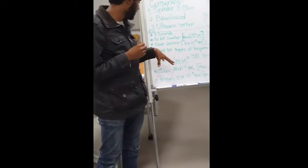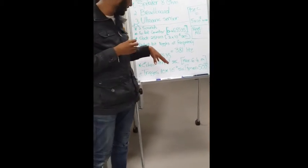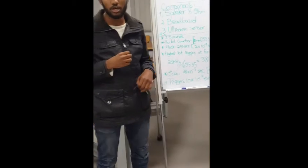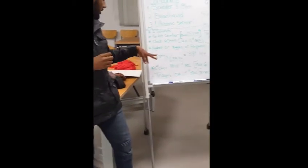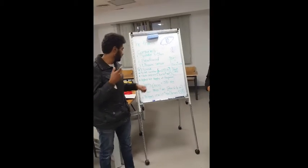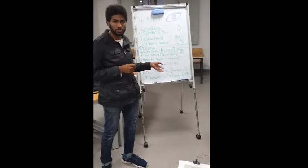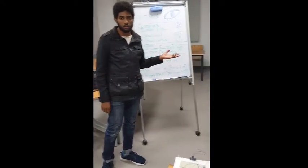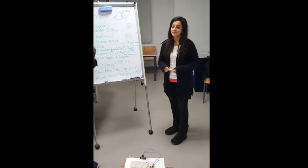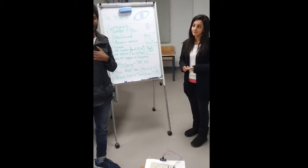And by the 38 times 10 power negative 3 seconds, we can get the distance using the speed of sound. It's the distance going and coming back. If we divide it by 2 and multiply it by the speed of sound, we can get the distance. And my friend Mirette will talk about how we generate the sound in the video.